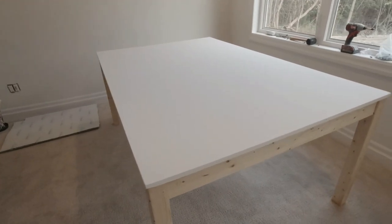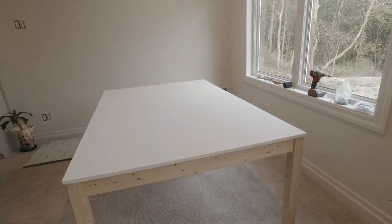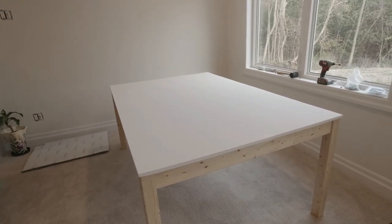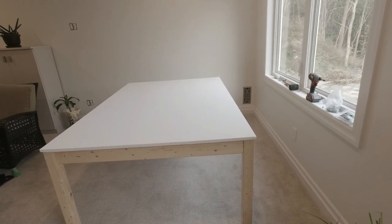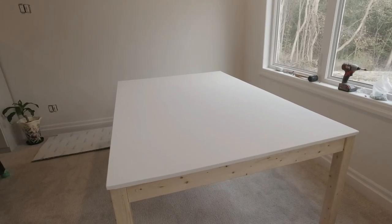There we go, we got it. The table is four feet by six feet. The frame is done with just plain construction two by fours, cleaned up and finished. The top was a sheet of three-quarter good-one-side construction plywood, and I painted it with a flat white paint. Just a little bit of a secret — it seemed fairly easy for me, but I have to confess that I actually am a woodworker, cabinet maker, slash carpenter — retired now, but that was my trade. So this type of work is not too difficult for me.